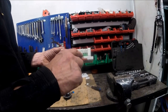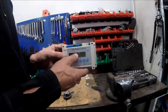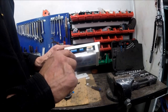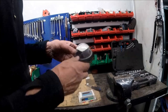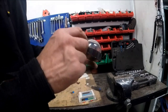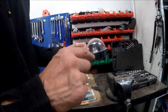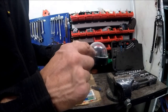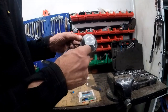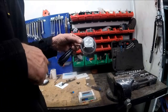Here they have connections for the linear actuators — an east-west motor and a north-south motor. Up on top you connect the photo cell that controls where the sun is. The photo cell is just a small unit with tiny solar cells sitting in four directions. What they do is measure the voltage between these cells, and it adjusts itself until it gets equal voltage from each cell, and then you are aligned directly toward the sun.